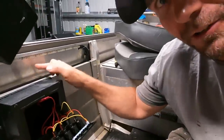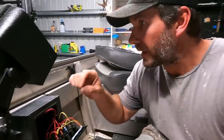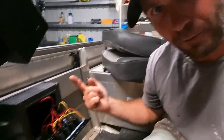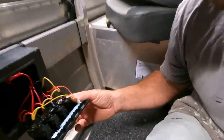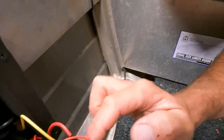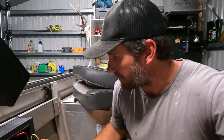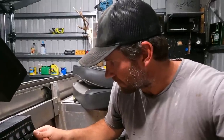Everything's powered up. What it's going to run: the lights - I've got a light on either side on the gunnel, left and right - and it's got power to the sounder. I've got a spare one with a hole and grommet where I can run power on this last switch if I need it, maybe for a little bait tank down the track. The best idea is to start with a small fuse in case you've done something wrong - it'll blow the fuse before it starts cooking your wires.